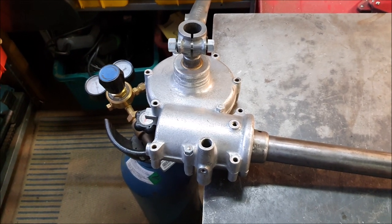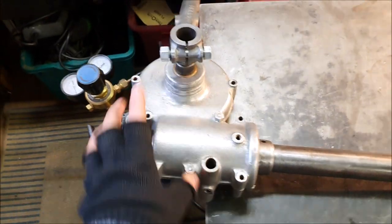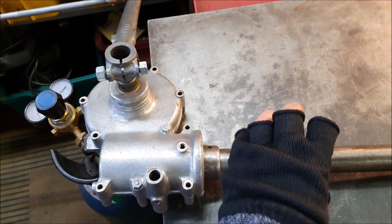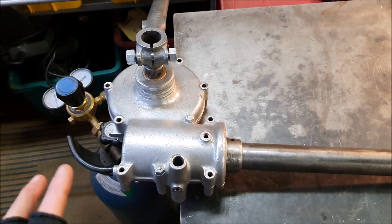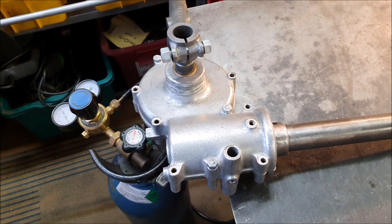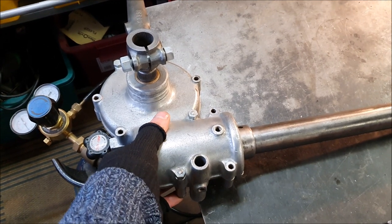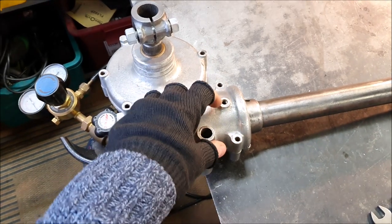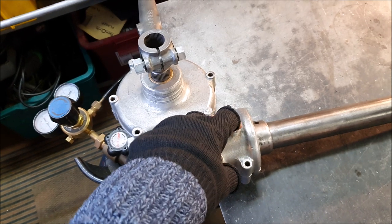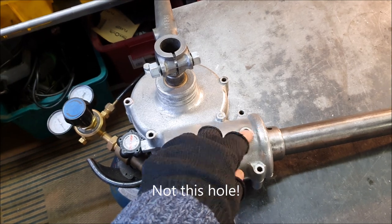What I need to do is rotate this shaft to adjust that and get rid of the play, but not make it so tight that it binds up and is hard to turn. It takes a little bit of backwards and forwards because to rotate this you need to loosen off all these bolts. I've only got three of them on at the moment. I have to loosen those, rotate this a little bit, tighten it all back up, retest it. When I get to the correct position, I'll put in all the bolts, check everything, and then because I've blued up the eccentric collar, I can score through this hole and see exactly where I need to drill the hole for the locating bolt.